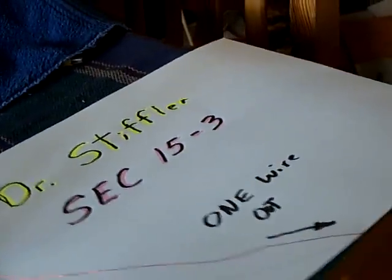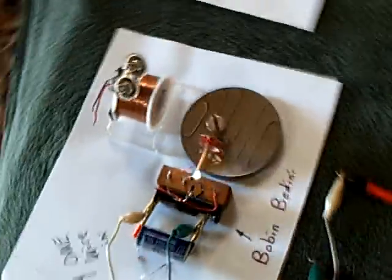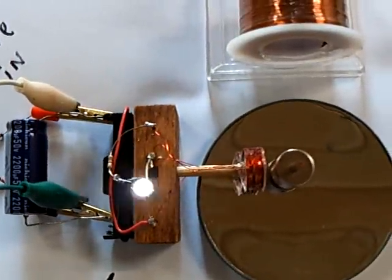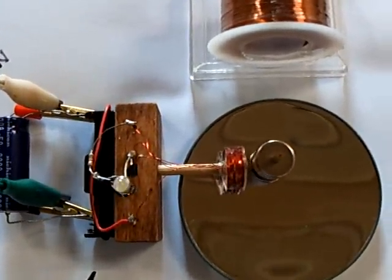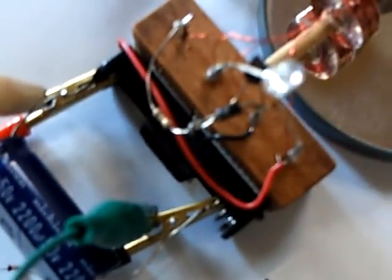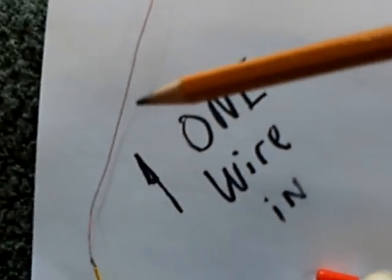I told Johnny I think I can run this quite a ways away, so I've got that little wire running way over here. That's my little Bob and Bedini motor running right there, and it's got a little pulse action going. There's the voltage on the cap. I've got the same cap that I had in my last video — it's a 2200 microfarad 50-volt cap, probably the wrong one, but it works. The energy is coming in to the unit through this one wire.